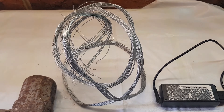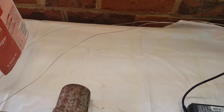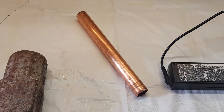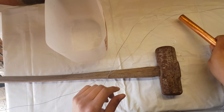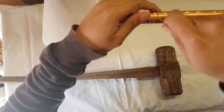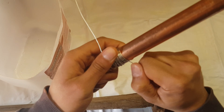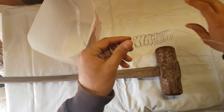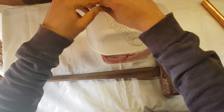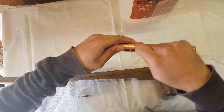I've got some scrap metal — this was from armoured cable that I used previously. I'm using just a laptop adapter which is actually supplying 20 volts DC. I wrapped the steel wire because it's scrap, and this is what's actually going to be removed as the sacrificial metal when removing the rust, into a bit of a coil, hoping that I'll get a lot more surface area.